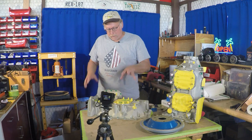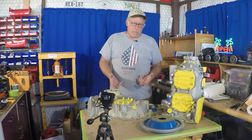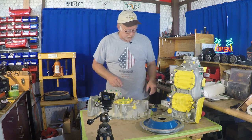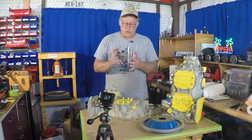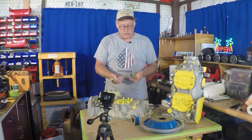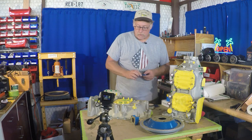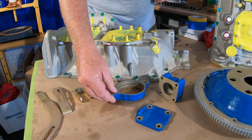If you're masking off a crankcase set you really want to do a nice job — just figure two or three hours. Most importantly, get everything masked off. We've cleaned these crankcases, we've measured them. Once we get done painting we'll remove all the masking, they'll be cleaned again, bagged, and prior to assembly cleaned again. We want to make sure there's no FOD — no assembly debris from machining or from what we've done. Here's a governor vacuum pump pad — we don't want anything where a gasketed surface is. Plated parts like the hoist hook, alternator bracket, and cooling bracket are just going to be left bare because that's where wrenches are going to hit.